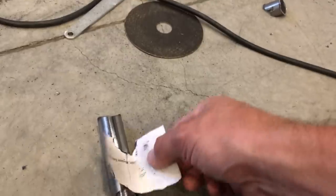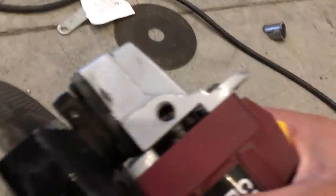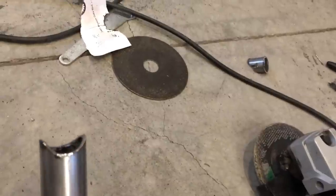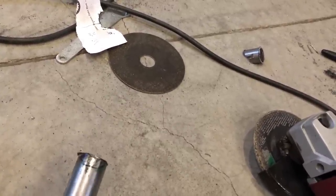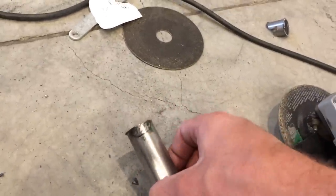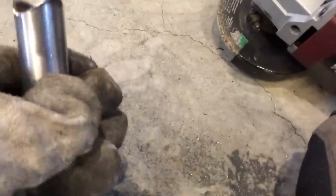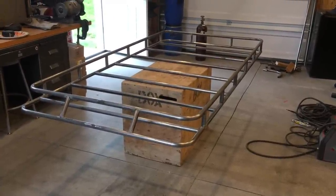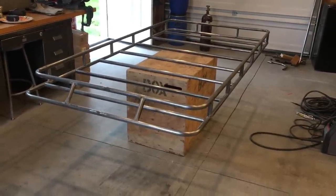For shorter pieces that don't fit in the jig, I've taken a little piece of paper, made a little template, put it on the pipe, drawn it on quickly, and then used an angle grinder with a fairly thick disc - probably quarter inch. I can grind out a saddle joint in less than a minute per side. I took this project on because I wanted some busy work - something fun to do. Wear a glove on your left hand because these get hot when you're holding them.